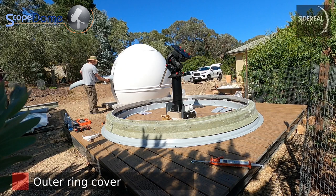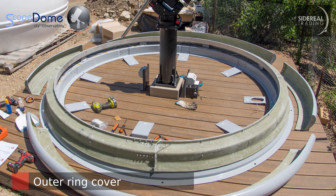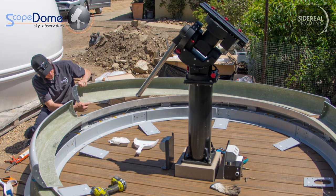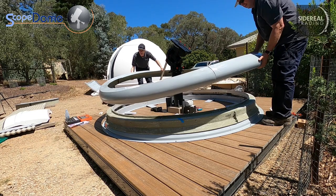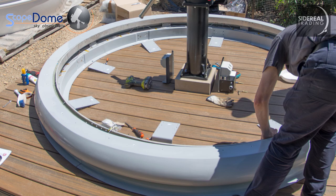The outer ring cover is for waterproofing as well as a bit of aesthetics. It comes in four pieces but they're not even - it's got short pieces in north and south, and longer pieces east and west. They're attached with silicone and bolts as normal. It's assembled upside down and then turned the right way up for installation. Cables that will go to the shutter control come between the rotating ring and the outer ring cover, and it's very important not to lose them. Finally, the reinforcing brackets are bolted on, and there are seven of those.